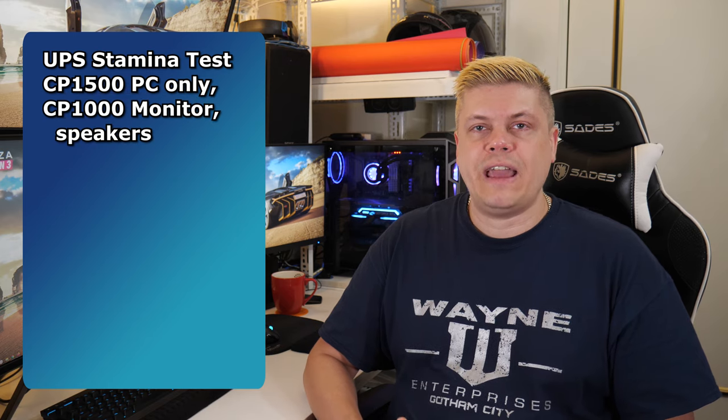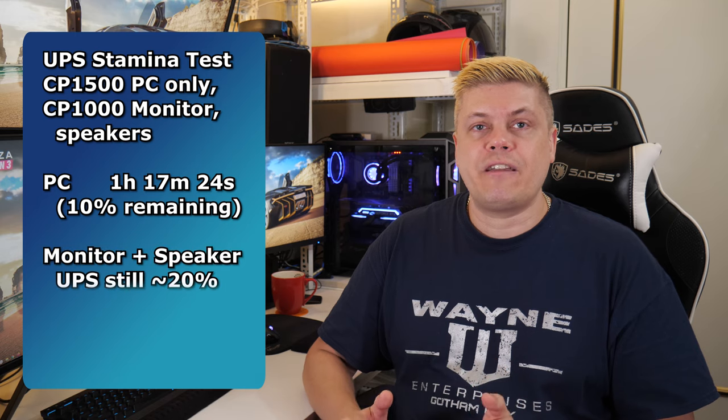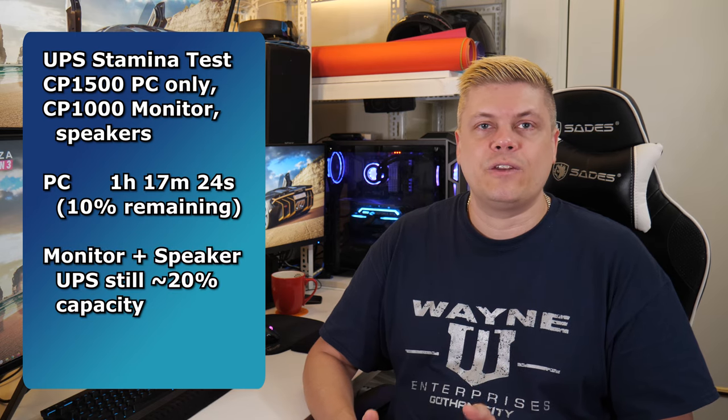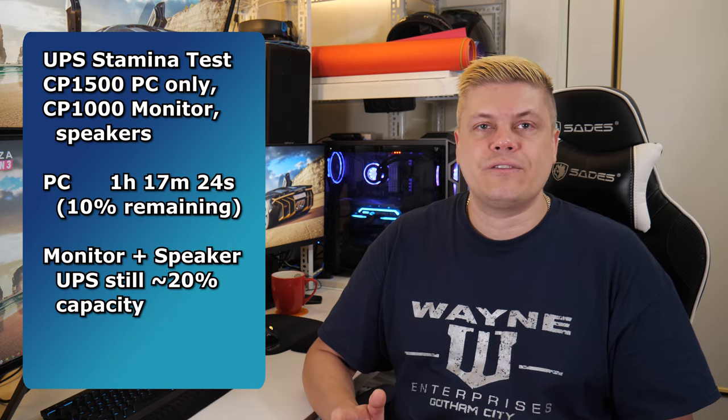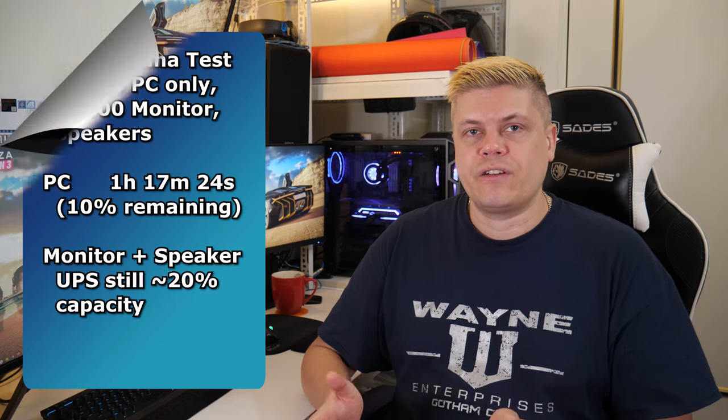After a full 8-hour recharge, we tried a stamina test, running the PC only off the 1500VA and the monitor and speakers off the 1000VA. And we reached a very impressive 1 hour, 17 minutes, and 24 seconds before shutdown was triggered on the PC, with the 1500VA still at 10% reserve.